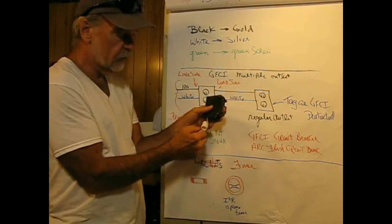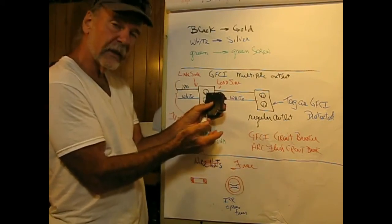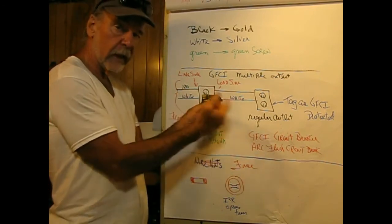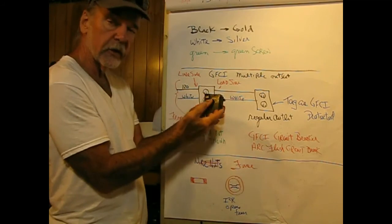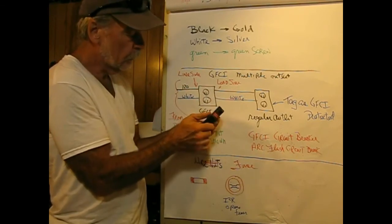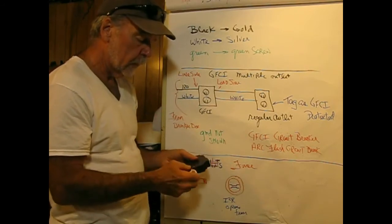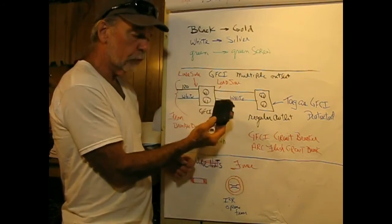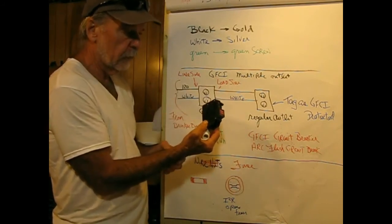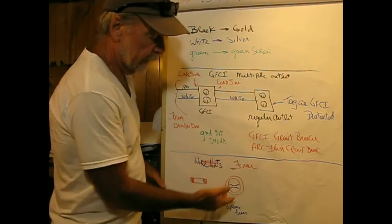And the downside of it is, if it turns itself off because of a ground fault, you kind of don't know exactly where it is. And a situation that happened is my neighbor had his house spray painted, and he had three outlets on the outside. Not spray painted, spray washed. And he got water into these, and you know, he says, I don't have any power. So I ended up going over and changing all three receptacles and getting them back in service again. So there's an upside and a downside to having a circuit breaker that's ground fault protected. Everything on is okay, and then if you have to identify where an actual fault is, well, a little bit more complicated.